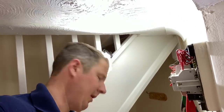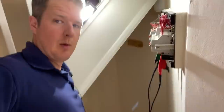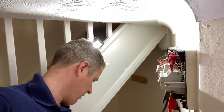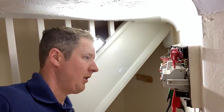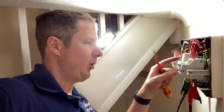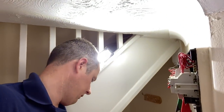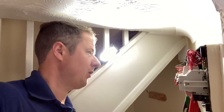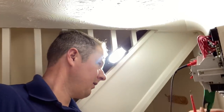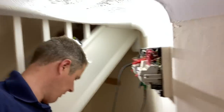Yeah, we've got all the lights. So if I turn the lights off, try that. Yeah, so the sockets and the cooker are all clear, phase to neutral, but the boiler circuit, obviously it's got things connected and the lights are all turned on. So I'll just put limitation for phase to neutral on those. I'll do the heating circuits as well, just to see what the readings are like on those.